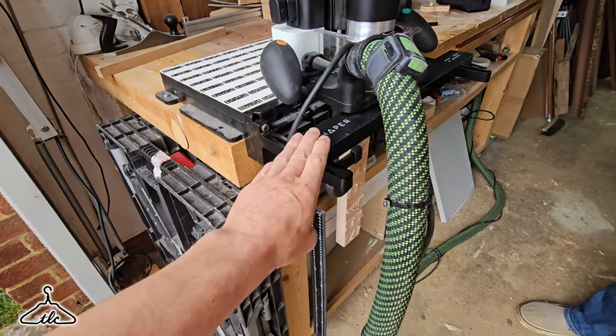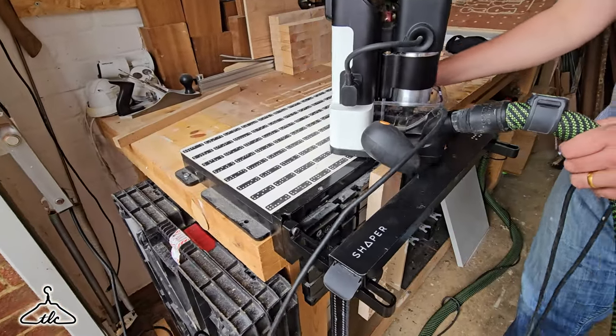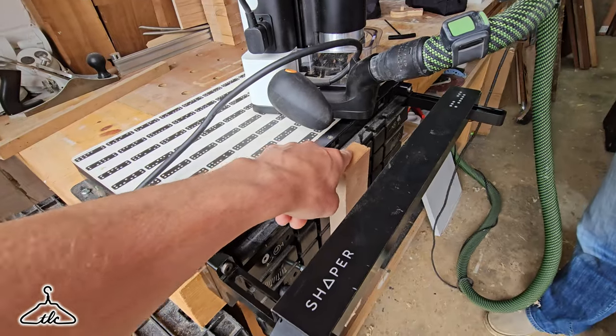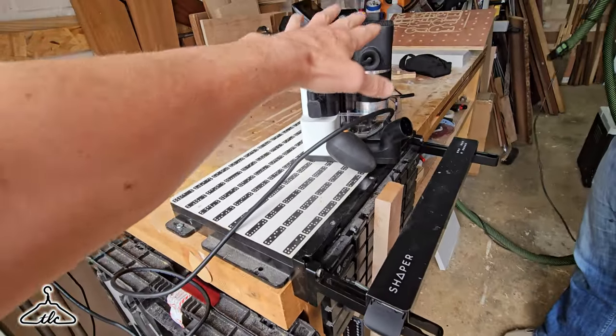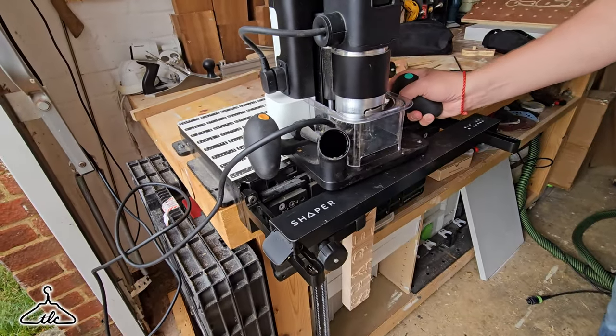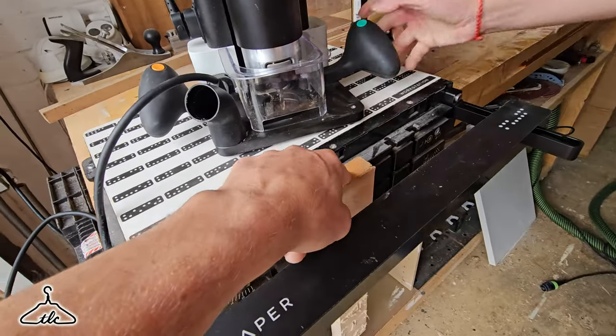So look how the spindle lifts up. Basically all you need to do is press the button and it plunges it. Look how straight the lines are — that's all freehand. We've got a little bit of roughness; that's because this is an upcut bit and you do get some tear-out at the top. But look how nice those curves are and the straight lines — you could never get a straight line like that freestyling. For me it takes just a few minutes to set the machine up, get your files in, and then the fun begins.